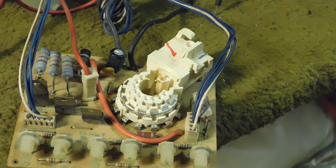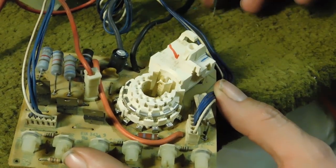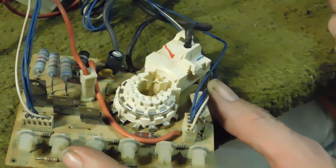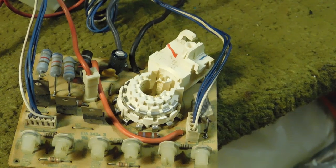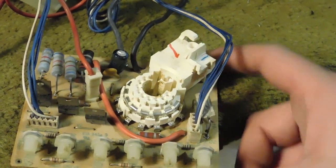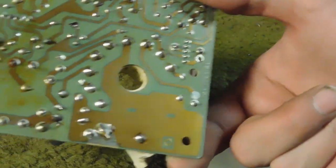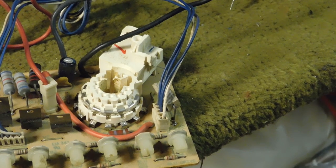At this point, if you were not going to replace your flyback, you would want to release this tab, flip it up, then take your wire and push it into this hole and push the tab back down — it'll lock that grounding wire into place. But since we're replacing the flyback, I'm not going to go through that here as there's no point. We'll do that in the next video when we replace the flyback and finish this piece up. That's how you replace your socket on a neck board for a CRT monitor. Thanks for watching — I'll see you on the next one so we can get the flyback done and get the rest of this chassis board done and put it back in the game.